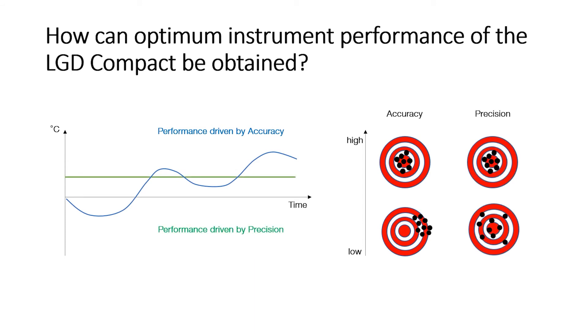This precision can be improved by averaging measurements over a certain number of measurement points. For example, 10 averaging points result in 3.3 times better precision. The user has the possibility to change the averaging points in our customer front-end, in the section Sensor Parameters under Integration Time.